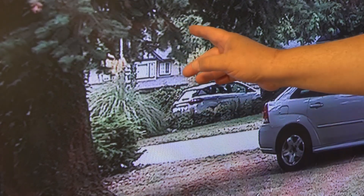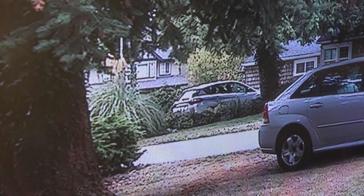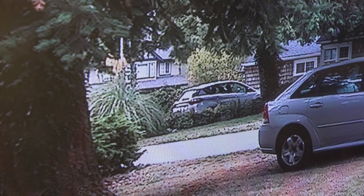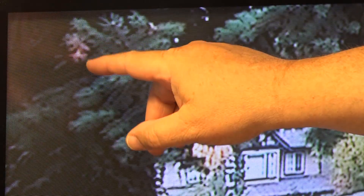The CCD uses a series of mosaics, typically four colors, so you've got alternating green with red and blue — you don't get the same effect. You can still see it if you look at the edge of the picture; you can see the filter there. It looks more like looking through a mosaic — you can see the color images moving behind the color filter — but it's nowhere near as bad. Now if I go into the digital zoom range, we're looking at fewer pixels and you really see it on CCD in the digital zoom, but it's still a vast improvement over the single tube camera.